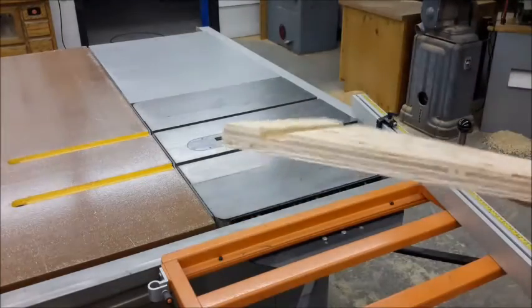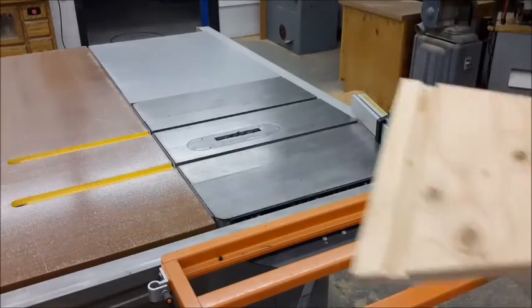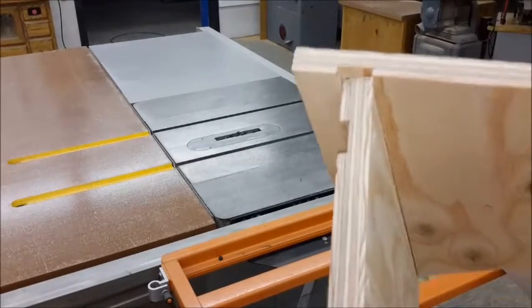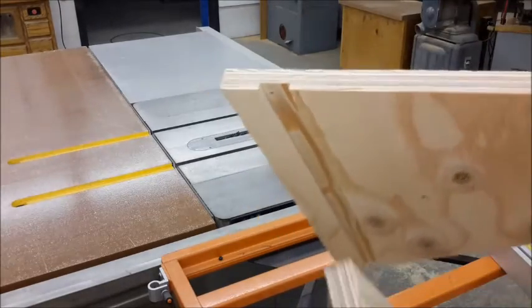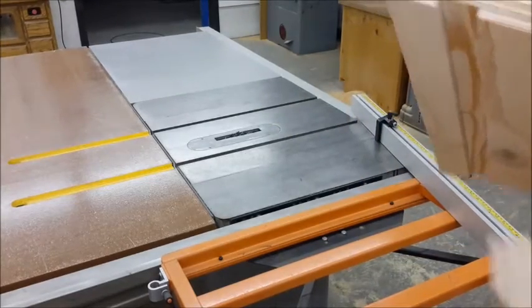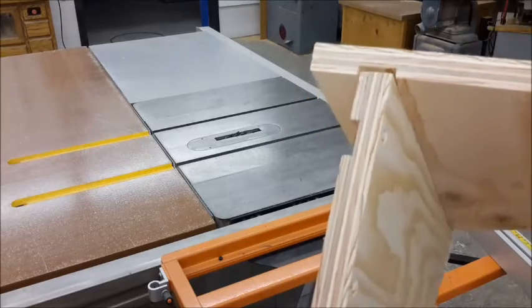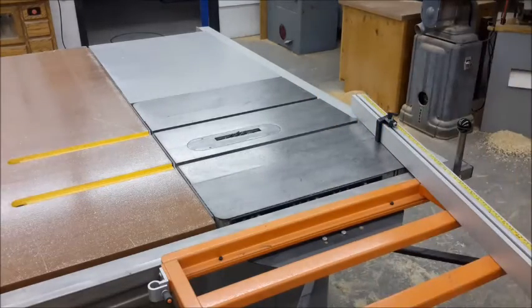And there it is, one groove, 3/4 inch wide, for instance. Ta-da! See, look, isn't that nice? Isn't that nice? Okay, so that's 1/4 inch deep, plenty enough to support it. By the time glue gets in there and screws get shoved in there, it'll be just magnificent. Okay, off to the next step.